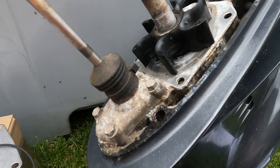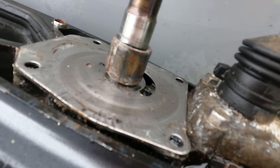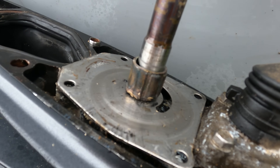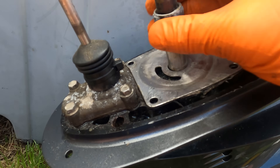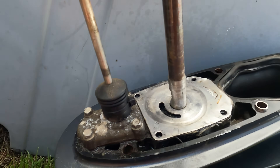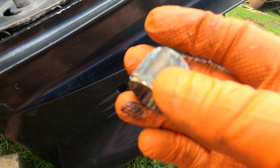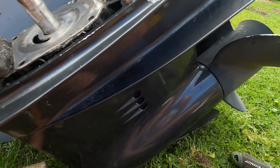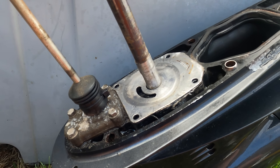We'll lift the impeller off now. Trying to get this impeller off — it's pretty well seized on. I tried to lift it off and the impeller came away from the hub — it's pretty stuck. After getting some heat on it, heating around that collar, I pried it off with some pry bars while it was still warm and got it off. The impeller was bonded to the keyway — I lost the keyway when it popped off, it went into the grass somewhere. But it's off and we can build the new water pump.